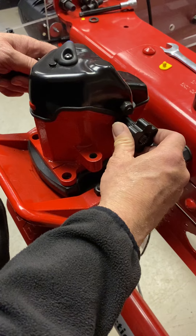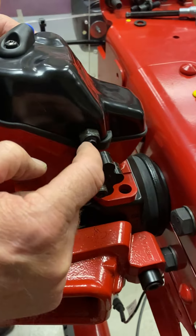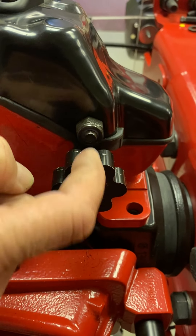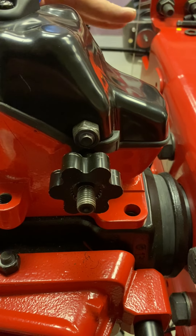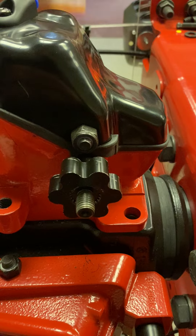To set the drive gear on the correct position, you have to have the cutout in line with the bolt head, so the V of the cutout is in line at the top with the handle, with the coupling in a closed position — so the handle, or the pin, has to be in a closed position.